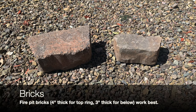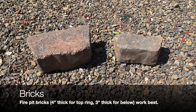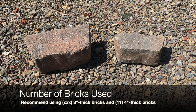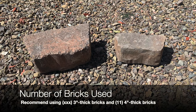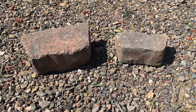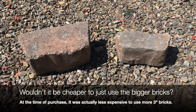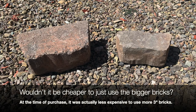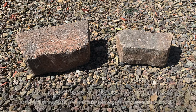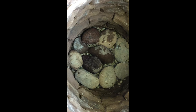The next material is brick. The amount you need is a function of both the diameter and the depth of the hole. The bricks I used were for circular fire pits and come in two sizes: three-inch thick and four-inch thick. I used the three-inch thick ones for the body of the hole and the larger four-inch thick ones to finish the top. Finally, gravel and river rocks will help hold heat in the bottom of the hole.